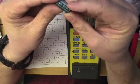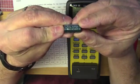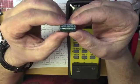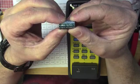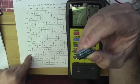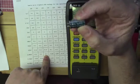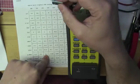This one here, as you can see, the brand name is SamXON — I've never heard of that capacitor company, but they did last seven or eight years. This one is a 1000 microfarad 25 volt. So if we look at our worst case chart, the very worst you should see is 0.1 ohms. I suspect this particular one is probably still okay, but I figured I'd change them all at once.